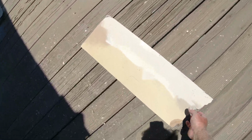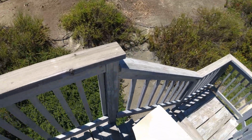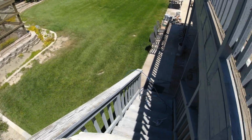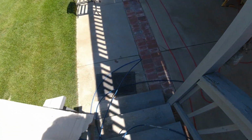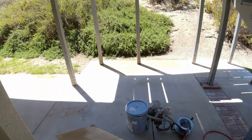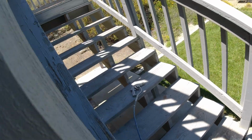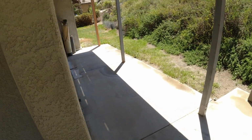So anyway, cardboard shields. I'll take those downstairs. All the ones I got, I only had about five or six, maybe seven. I just scrape them off on the wall, put them in the sun, and let them dry. You don't need a hundred or two hundred cardboard shields to do a job. I always try to keep paint on one side of the shield while I'm using them. So I'll put them in the sun, let them dry, and keep using that same edge, because I don't want to grab onto the painted side with my hands.